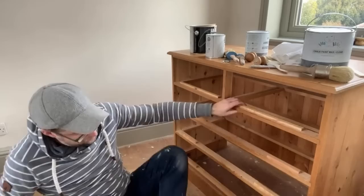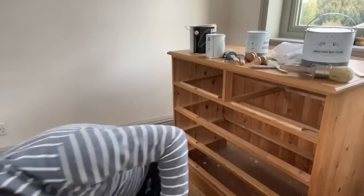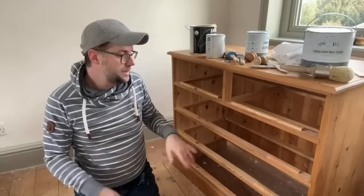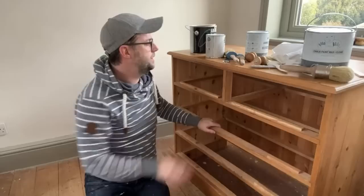For any other prep on a basic paint finish: cleaning, preparing handles, masking tape, and generally checking the piece. If it's second-hand furniture, you might have a chip or a piece of wood missing — in that case use a quick-drying filler or two-pack filler to fix it, sand it away, make it neat. Make sure it's well sanded because any lumpy, bumpy bits will show through your paint — they'll catch the light if not sanded smooth.